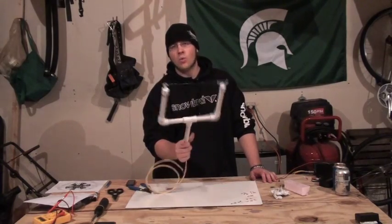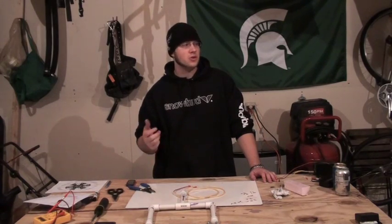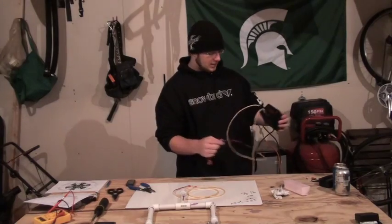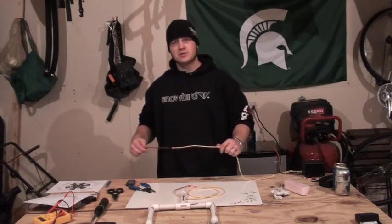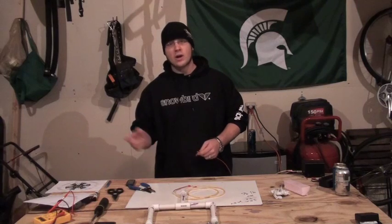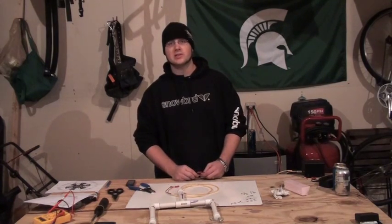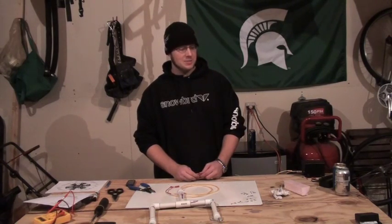Looking at that, you need about 10 watts to power this thing. If you have a 10-volt, one-amp phone charger or battery charger, that might be enough. Otherwise, I'm partial to these tattoo power supplies, but you'll almost certainly have to put one of the inline resistors in with this one. Go ahead and check the troubleshooting section — I talk a little more about that there and use one of these smaller units to exemplify it. Other than that, that's it as far as the mini hand cutter goes.